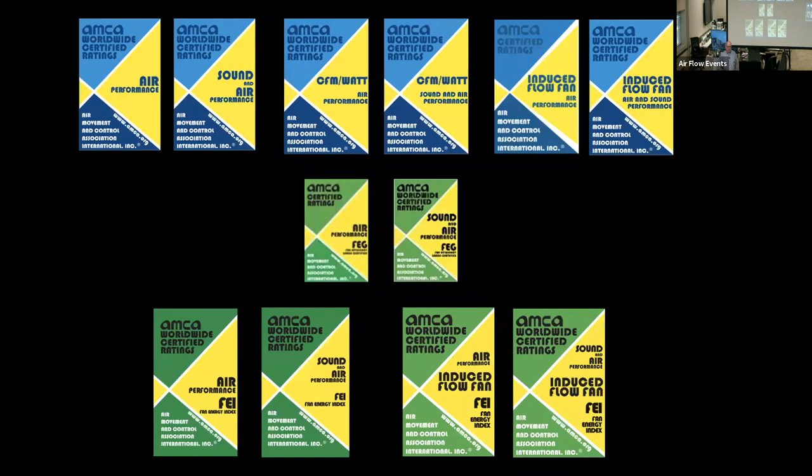So there's a wide range of certified products, and here is an example of this. The center ones, the fan efficiency grades, those have gone away. That was a method that was discussed early for efficiency compliance that has now evolved into the fan energy index, and you'll see those on the bottom. You'll see the older style certifications, the blue and yellow, and now the newer efficiency, as well as the air and sound performance, the fan energy index. Those are the types of certifications that are on that.